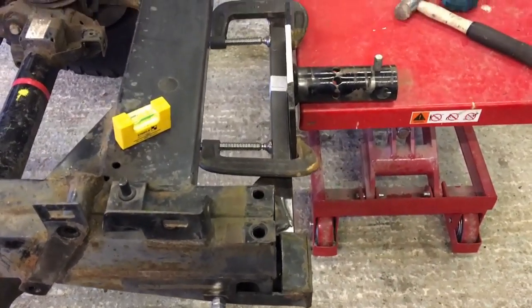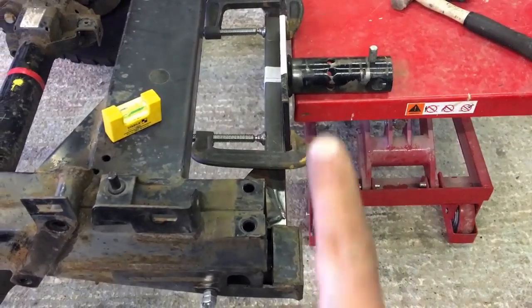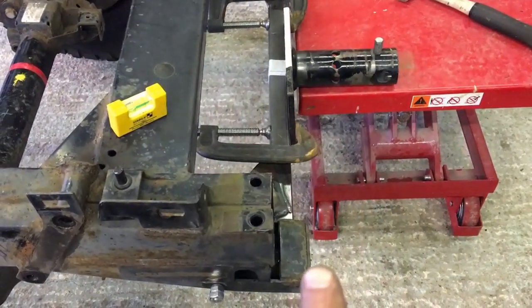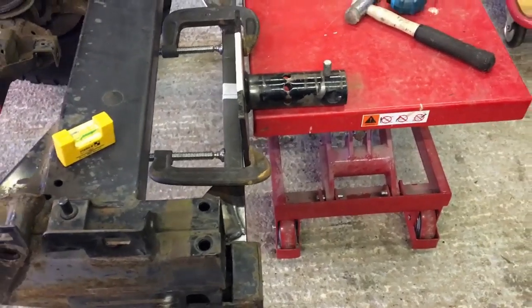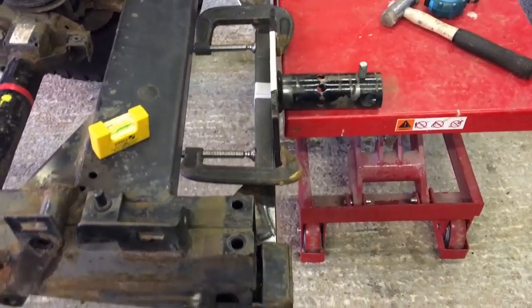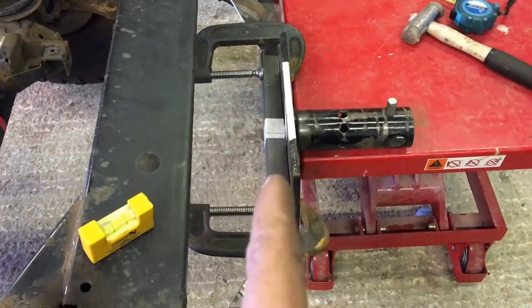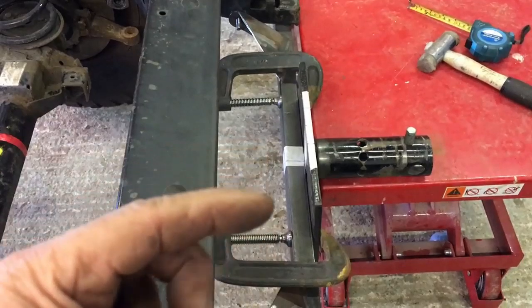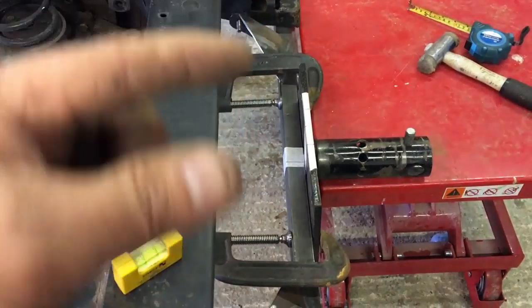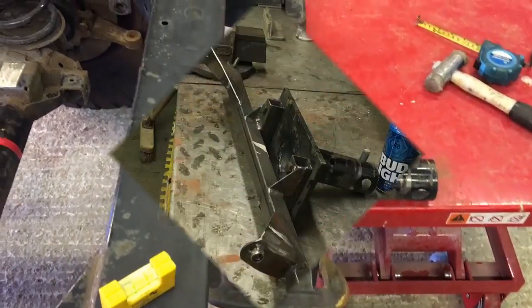If you look at this now, when I put the actual upright on here, as it swings round, it's going to be very, very close to these dumb irons. And what I'm worried about is that if I catch my hand in there, I'll just take my hand off. So I'm going to have to space this out away from that box. What I'm going to do is put two vertical uprights on that plate and then gusset those uprights into this tube. So I'm going to get on and do that now and then I'll come back.